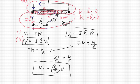Or it could not be zero, and your battery on the top could be so weak that the battery on the bottom actually pushes it the right way around, you know? Or in this case, the galvanometer is zero, which means the current coming out at the bottom and going down to the top cancel, which means no current is flowing on that strip there, just like with the Wheatstone Bridge in the center of the bridge.